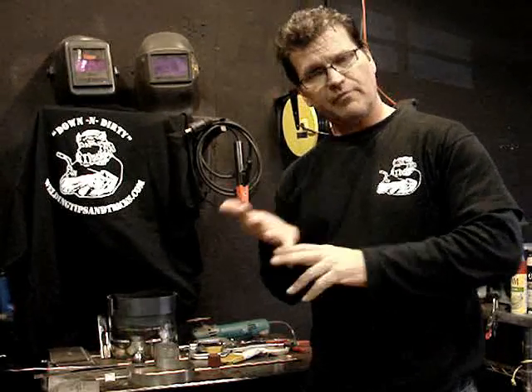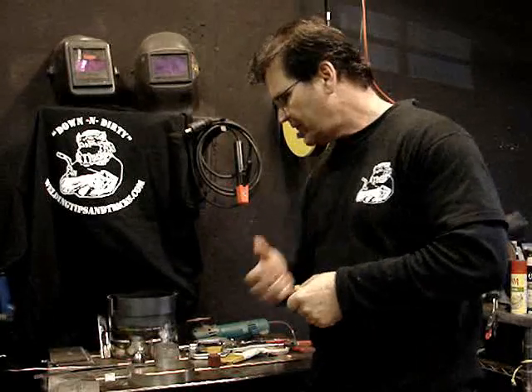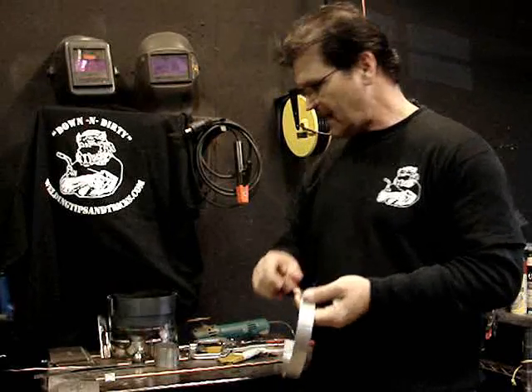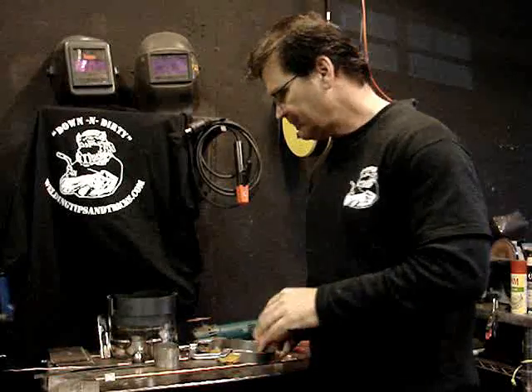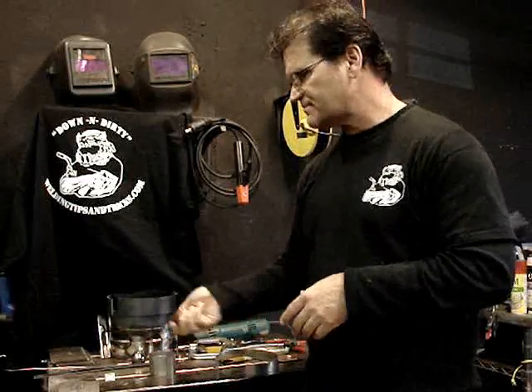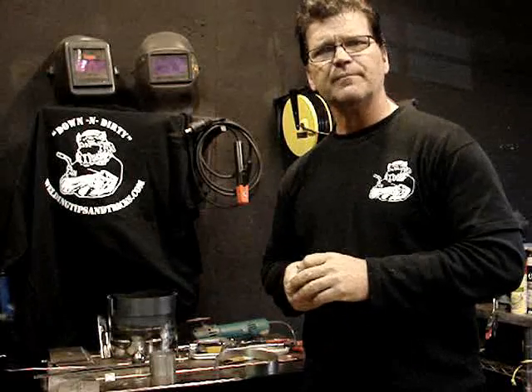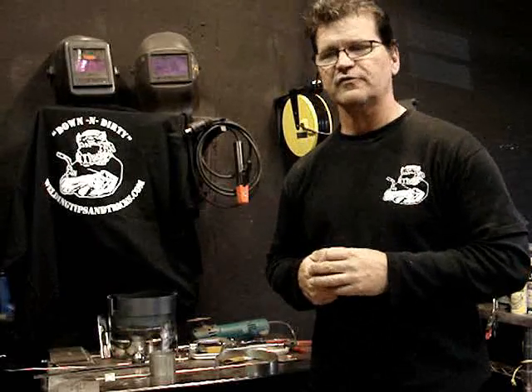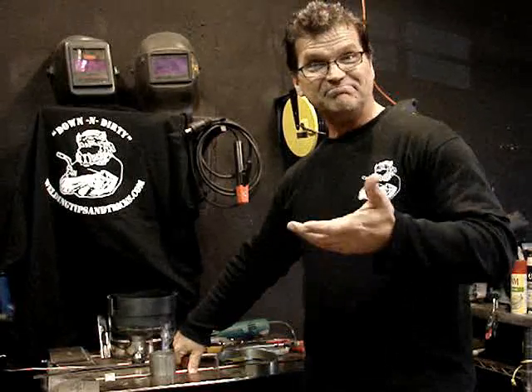A couple of myths first. One myth we already talked about: stainless steels are non-magnetic. Well, we know already that some are — 301 is pretty magnetic, it'll almost hold its own weight. 400 series are almost as magnetic as carbon steel. Another myth: stainless steels don't rust. Anybody that's into marine hardware knows differently. It largely depends on how it's treated when it's welded. If you get it too hot, or use a carbon steel wire brush, or a stainless wire brush that's been previously used on carbon steel, you can introduce free iron particles and carbon and cause rusting, especially when wire brushing a hot area — a little moisture, you're going to have rust.